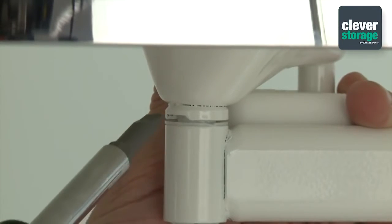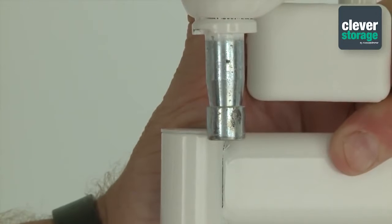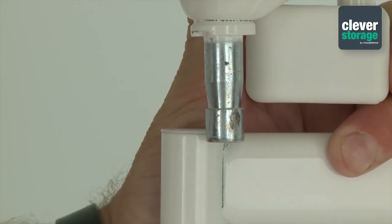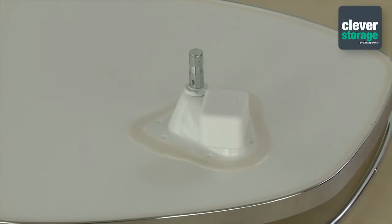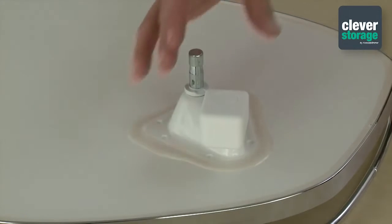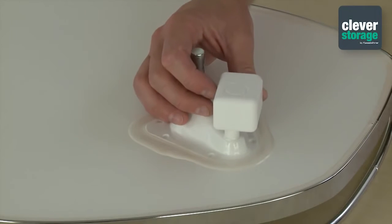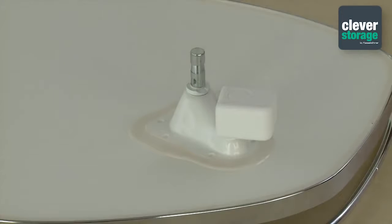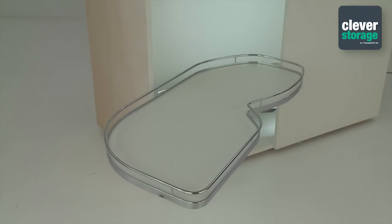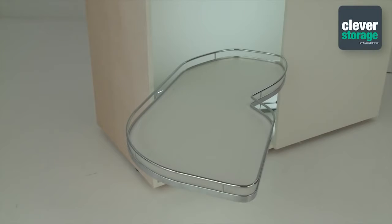If you need to adjust the height of these shelves, the shelves can easily be removed with a flathead screwdriver which is wedged in between the pin and the hole. There is a built-in adjustment block installed on the rear of the bottom of each Lemans shelf. This block can be turned into different positions in order to restrict the travel of the Lemans trays out into the room if you have limited clearance. You can see that the Lemans will extend into several different positions based on the turn of the adjustment block.